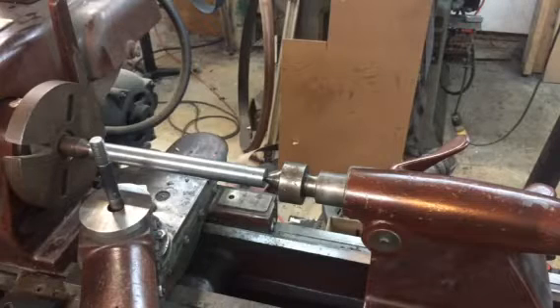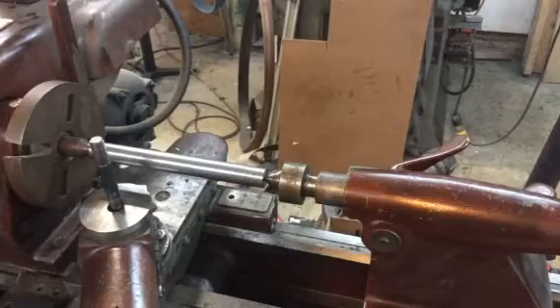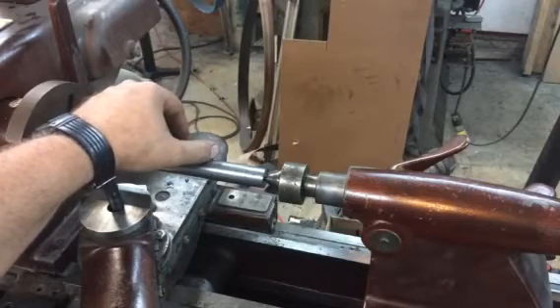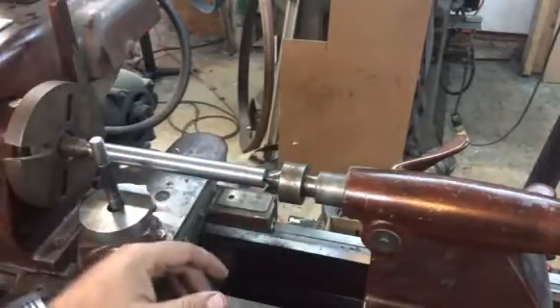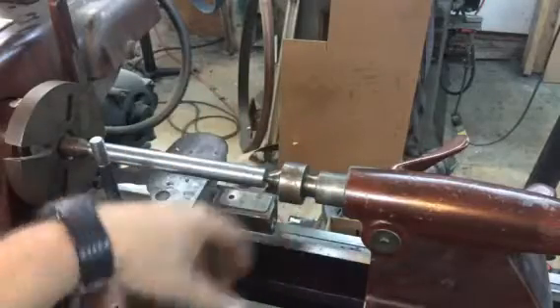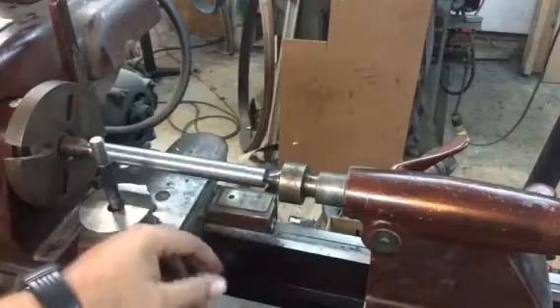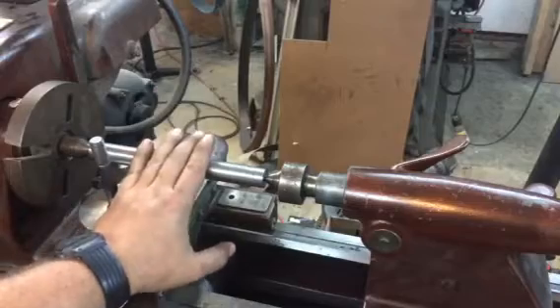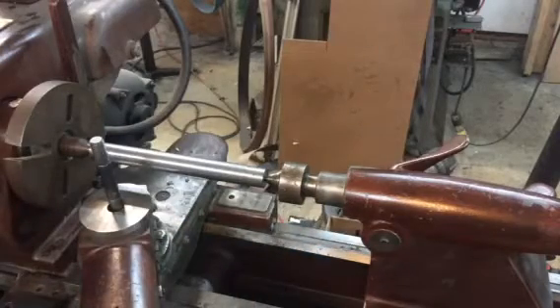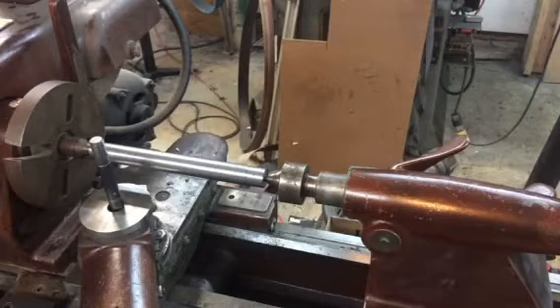It may need a little bit of fine-tuning to get things as centered and as true as possible in relation to your spindle. I've done quite a bit of research on various techniques for truing this back up with the spindle, and most of them involve some fairly elaborate indicator holders that often mount to a faceplate or a chuck and are used along with a dial indicator to measure either the inner bore of your taper, the outer side of a chuck, a tool bit, or even an indicating rod or a test bar. Each of those methods are probably a little more complicated than they need to be — you have to have either special indicator holders or precision-turned test bars, which can be quite cost-prohibitive, anywhere from $50 to $200 or more.